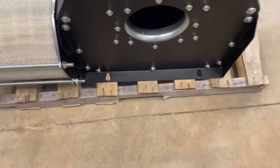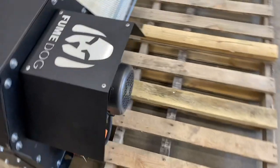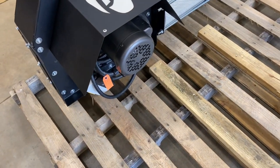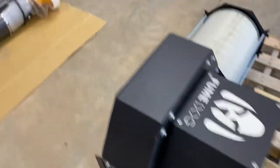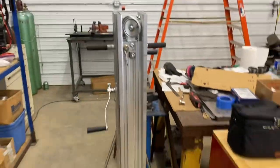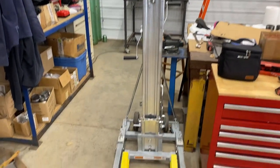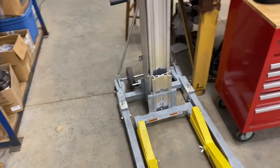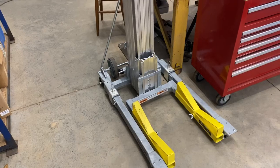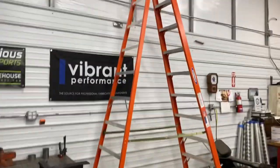This thing comes with four mounting points, mounted 16 inches on center. For those of you with a more conventional build, you'd obviously want to spread that load out. Another thing to note: this thing's pretty heavy, so I rented what they call a 12-foot contractor lift — a manual contractor lift — so that should come in handy getting it up there.